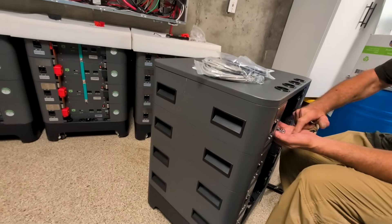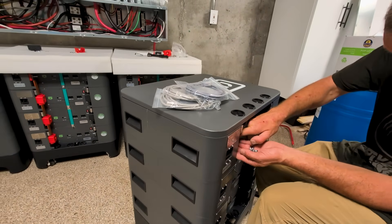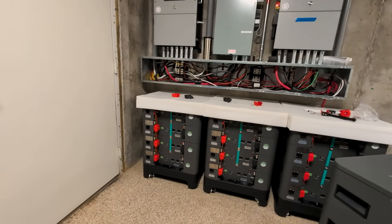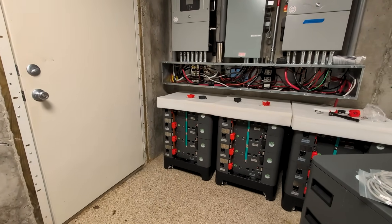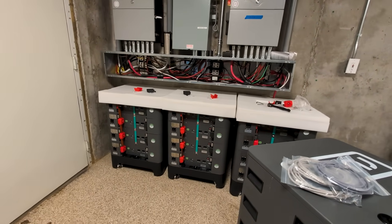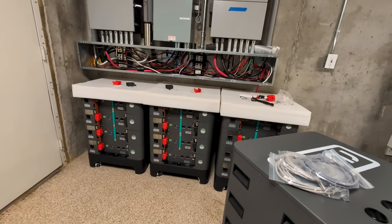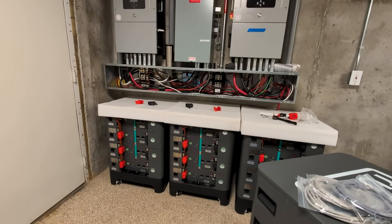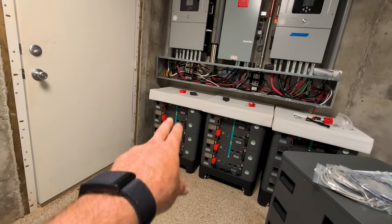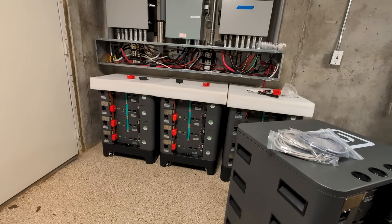Got all 16 of the new Rubik's stacked batteries on their lids and bases. We're going to tighten up their spacing and move them to the left to line them up with the gutter, with one extended out. We've more than doubled the battery capacity at this location. The customer wanted to tuck the batteries up under the system, so we did it. We're wiring them up now — they've got nice jumpers and nice bus bars for the grounds, which is neat.